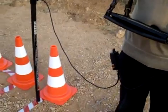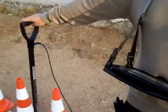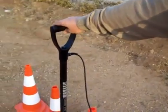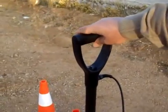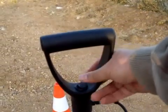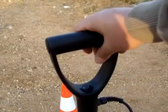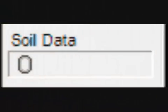and free from metal. Extend your arm away from the screen and your body. Place the magnetometer tip on the ground, far from any metal. Power on, and wait 15 seconds, completely motionless, while the Geo Examiner will automatically zero the soil data. And then start scanning, with the magnetometer tip touching the ground on each step.